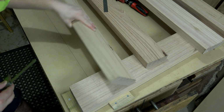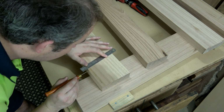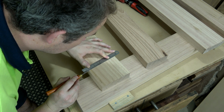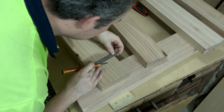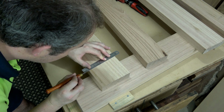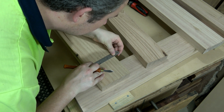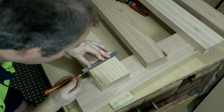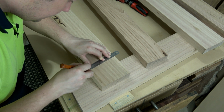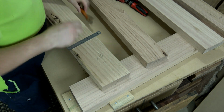And when you look at them, make sure they're all lining up. Yeah, looking wonderful. Alright, so I'll put the tip of the knife in one of them, and then this way I just have to use my eyes and line it up as close as I possibly can. You'd be amazed how accurate you can be doing this. Remember, it's a knife line, it's not like a pencil, it has no thickness, so you can put it right on your mark and you can be bang on perfect. Plus or minus 0.1 thou. I wish. Voila! Same to the other side, and we can chop them out.